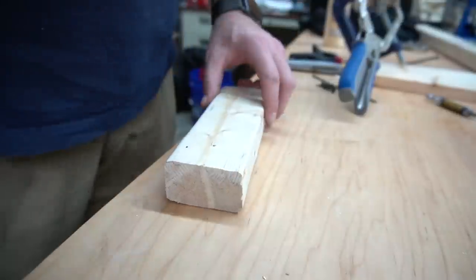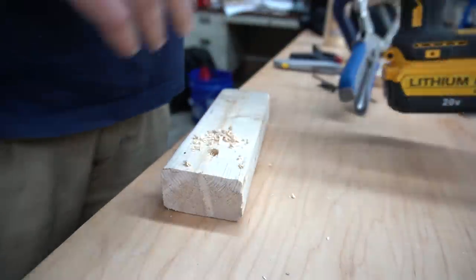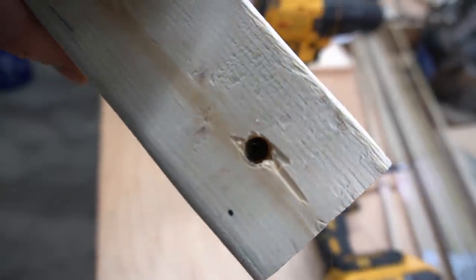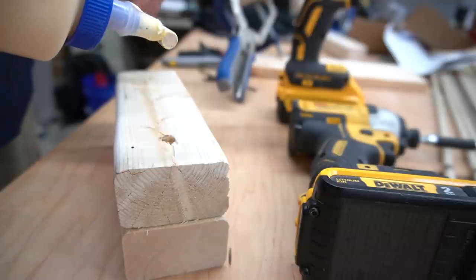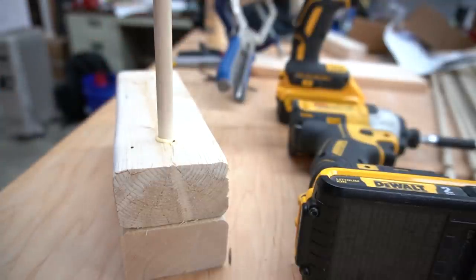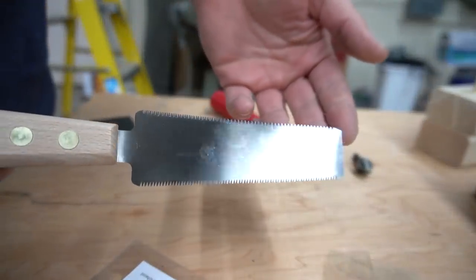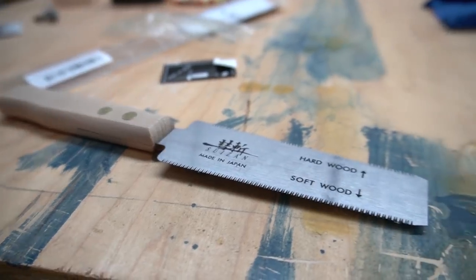Pre-drilled hole, bore it out with the three-eighths. Probably went a little slow on that and chipped it, but that's fine for what I'm doing. So this is when the screw gets run in. Now you can see the screw head in there, and I'll just get this dowel and simply glue it in. I probably would have made this hole a little tighter if it was anything other than a quick test. Then I'll just let that dry, come back and flush cut it. I've really been looking forward to using this pull saw — I'll leave the Amazon link in the description. It's one of the smaller pull saws, but for everything I do it's going to be more than enough.